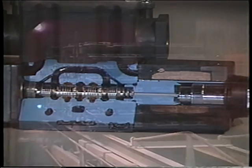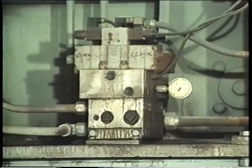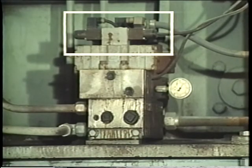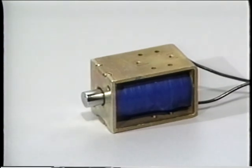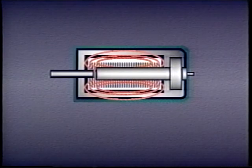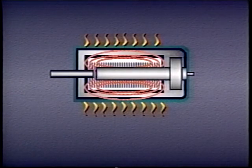If air temperature around the solenoid is too high, the coil may not be able to dissipate the heat it generates, even when current is at the lower holding level. The insulation on the coil windings may age rapidly and the coil will short out. Low voltage may also cause solenoids to fail — at low voltages, the coil may not develop enough magnetic pull to seat the plunger and move the spool as quickly as it should. Until the plunger seats properly, inrush current will continue to be high, and the coil may get so hot it burns through its insulation and shorts out.